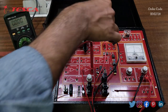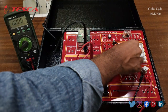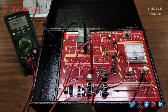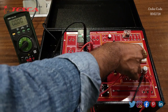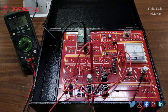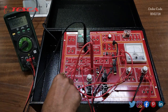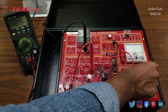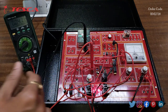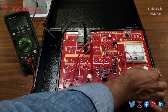Now we will connect the other port of the lamp filament to the positive of the moving coil meter, and connect the negative of the moving coil meter to the 0 volt. That is how the connection is done. We will switch on the kit, but first keep this 10k pot at the fully clockwise position so that the resistance value is minimum.